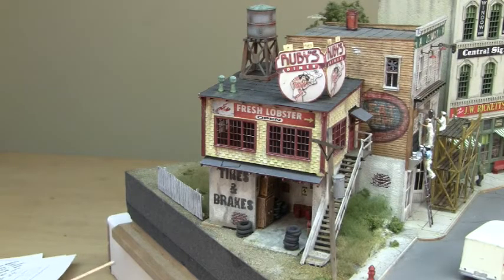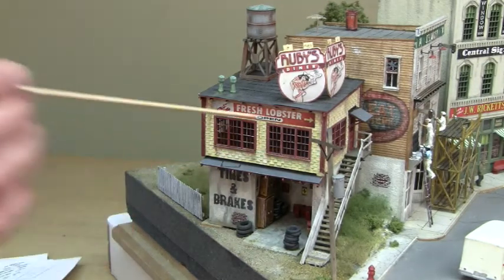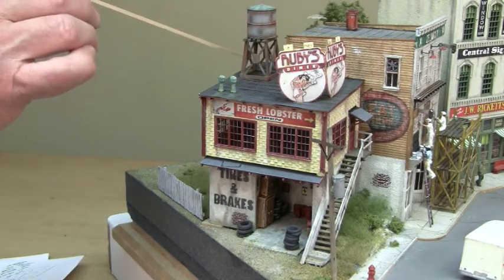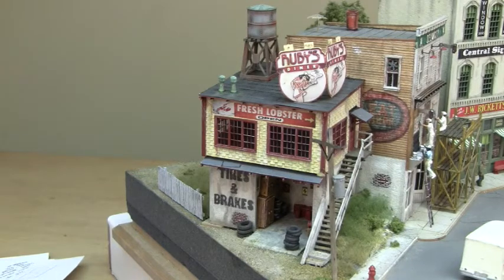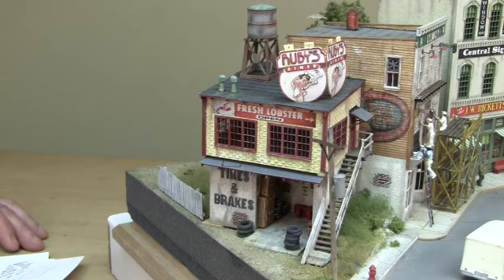The next thing is you're going to put your four pieces of the four walls together. This short back wall, try to keep these two corners and these three corners as square as possible. That'll give you this little jog being square also. That is a bit of a challenge, so take your time with that, and use a square to get them square.